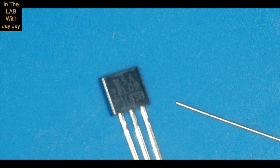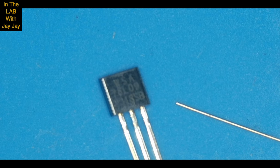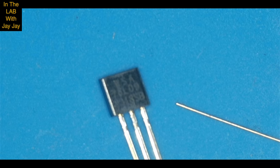Four integrated circuits, some jumpers, and then some power. There's an LED, printed circuit board, and it looks like M3. So those are some sort of screws. I don't know what they are. Maybe these. Maybe. I don't know. Alright, well, let's just take it from the top, and we'll put the things in the order that they're listed. Why not? I think we've got all of the components, we know what we're dealing with. We're going to need our soldering iron. So let's get the iron on. Set at 350. 350 ought to be good enough.